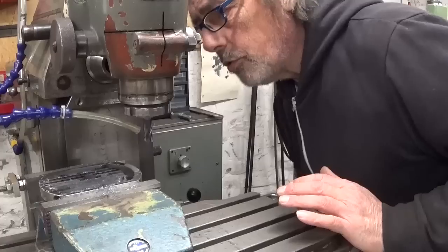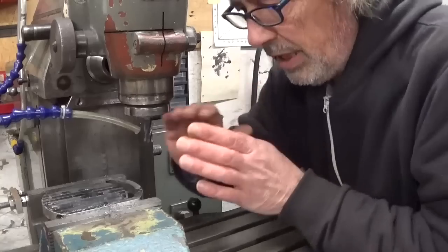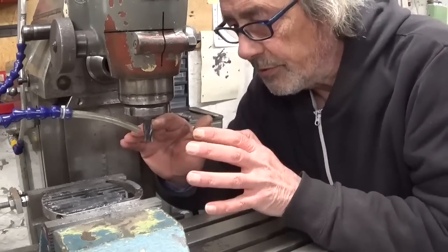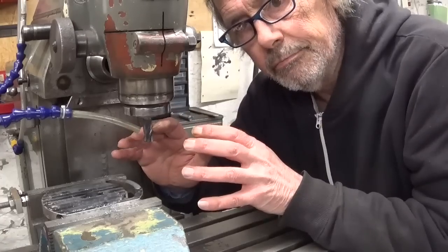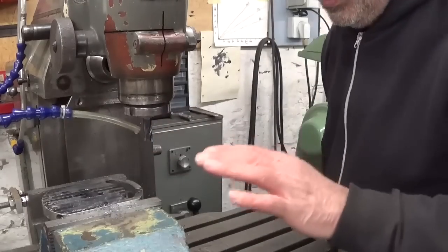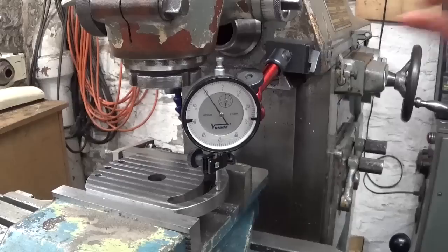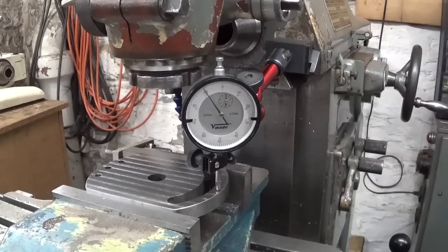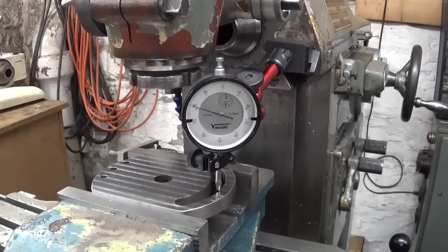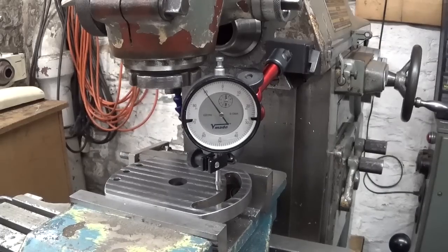Man, that took forever — but a few minutes on a milling machine and you can make whatever you want if they give you enough time to do it. Let's clean it up a little bit and take some measurements before I take it out of the vice. Same test again — indicator on the small surface. I think we can conclude this is the same height.